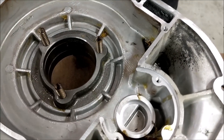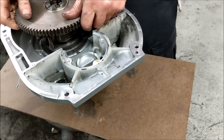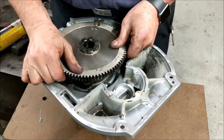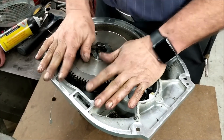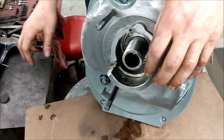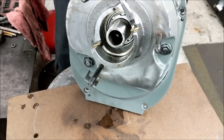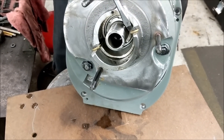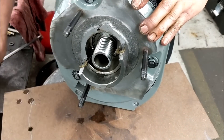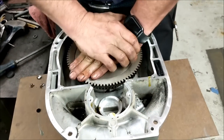If you look down inside you see the two little brass tabs, and there's a hole — that hole is where your adjustment is, and it's going to match up. When you put this in, put it down at this angle and let it get to its position. If everything goes well it'll drop right in. If it's sitting on the tab, pick it up — you can see how it's over on the tab — and use a screwdriver to ease it into position. It's a very snug fit and it's supposed to be. Once it slips down below, push it all the way down and it springs back up.